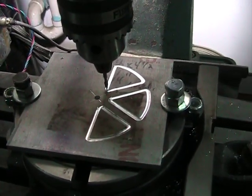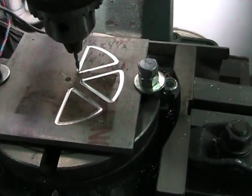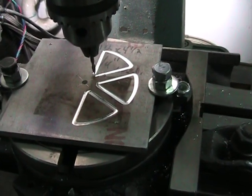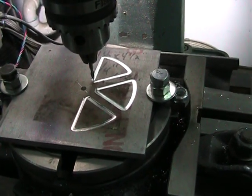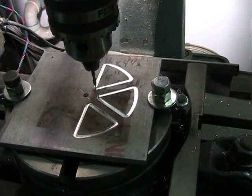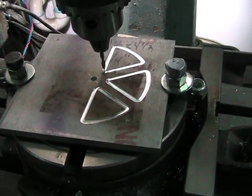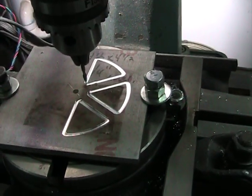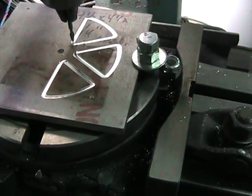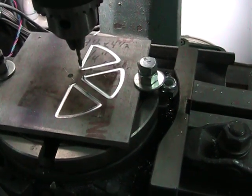What I'm doing here is showing how I can use a fairly simple G-code program to cut these pie-shaped wedges one at a time, and then manually rotate the rotary table one-sixth of a turn and repeat the process. Right now you can see I've cut the third pie shape. This takes 15 turns to do one-sixth.